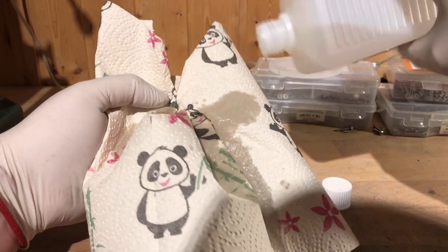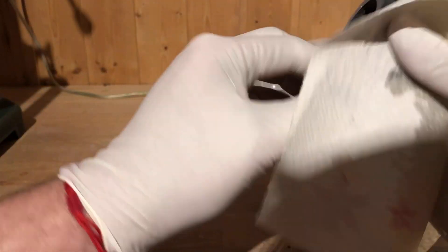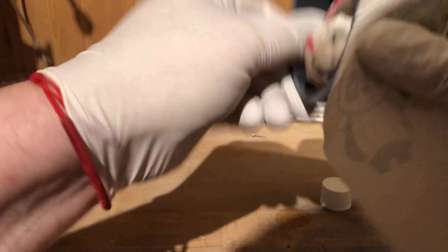Finally, I cleaned the chamber with isopropanol. The plexiglass disc, which is made of polymethyl methacrylate, must not come into contact with ethyl alcohol under any circumstance — otherwise, stress corrosion cracking will occur.